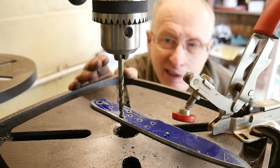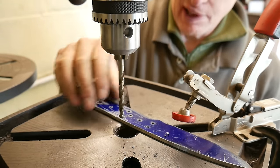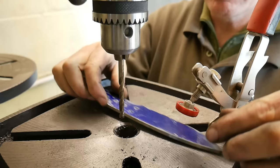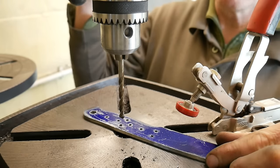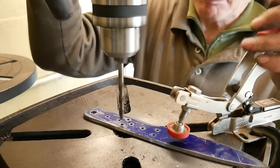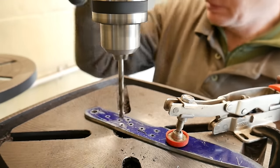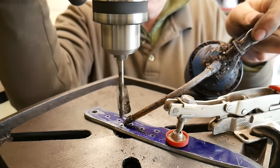This is a new workshop angle for me - I've normally got you over that way, but hopefully it'll be a good angle for you to get a good view of what I'm doing here. I've got the clamp that I fabricated. I want to drill these central holes, so I tend to start the drill up, bring the clamp down just lightly, just set them in the drill. I've got my cutting fluid in an oil can, so a little bit of cutting fluid.